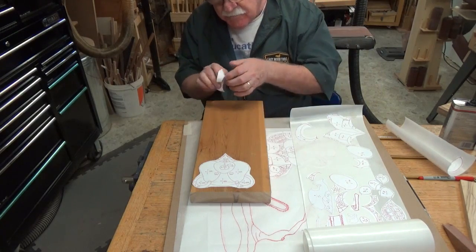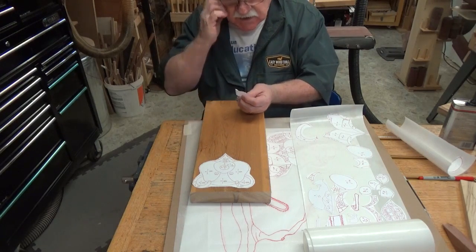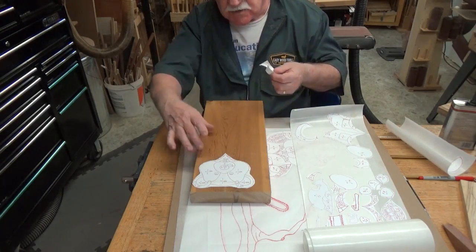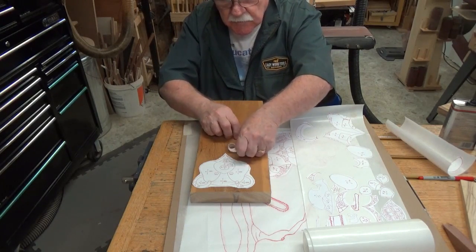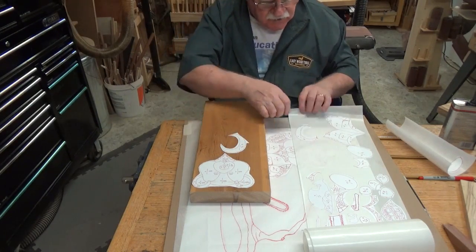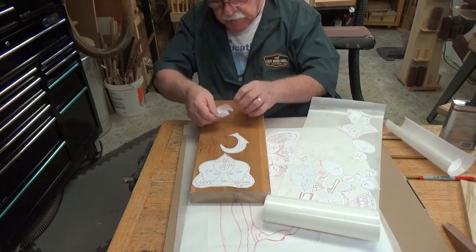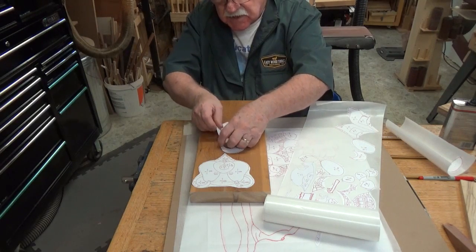The tight grain, when you're shaping, tight grain tends to chip a lot. So I'm going to try to stay kind of in the center of this board. This seems like I'm wasting wood. Don't worry, this wood will get used someplace else. But I'm going to position all my pieces so I'm making use of that center flat grain area, and that way we won't have so much chip out when we're trying to shape and sand these pieces.